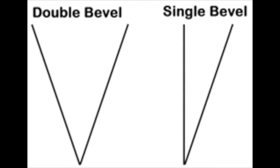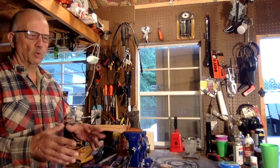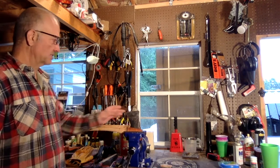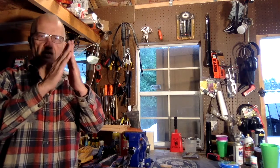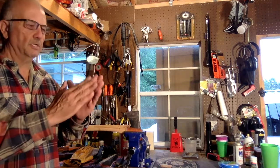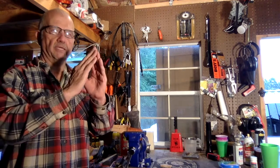You could look up bevels on different cutting edges and there are thousands of them. We're going to focus on just the straight flat — it's called a flat bevel. It's a double bevel and it's almost a point, just a straight-up point. Then you have what's called the convex, which is where it's a little bit wider right before the edge and it comes in.